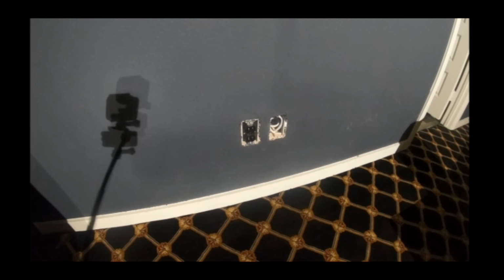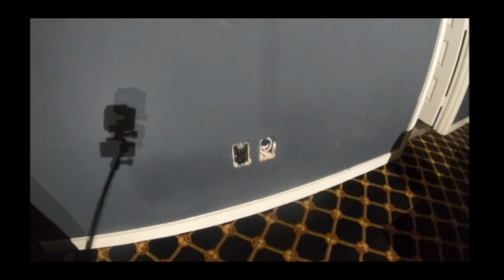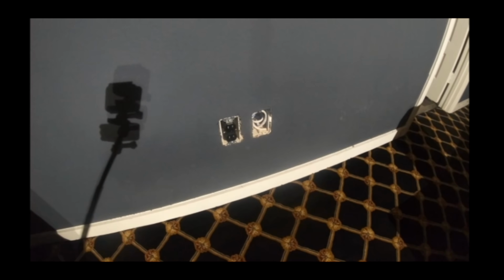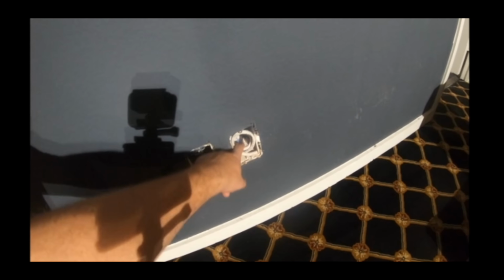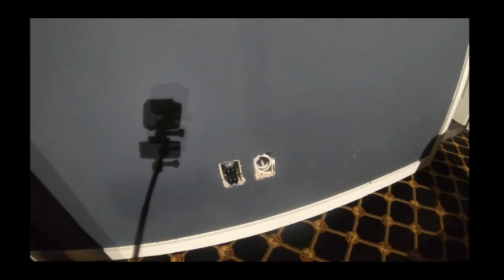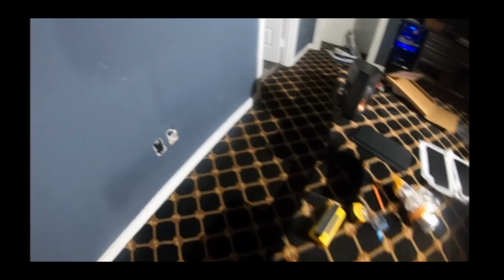All right, we are on the side of the room looking to hook up our surround speakers. As you can see, the cable's real low, a little low for hanging it at ear height. So everything's going to be on this platform. The seating's going to be on this platform. So I've measured about ear height, which is 54 inches, which is right here at my first mark.